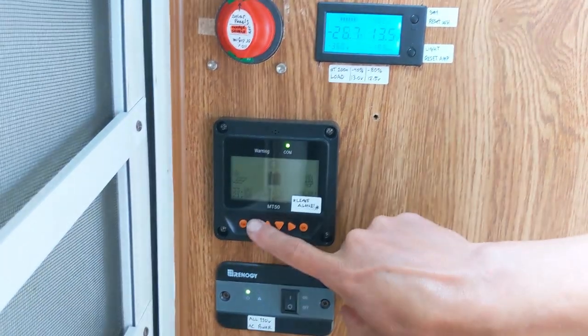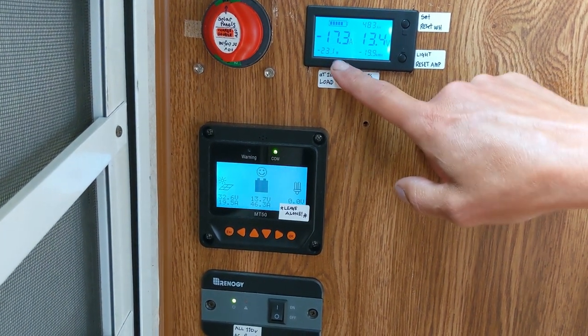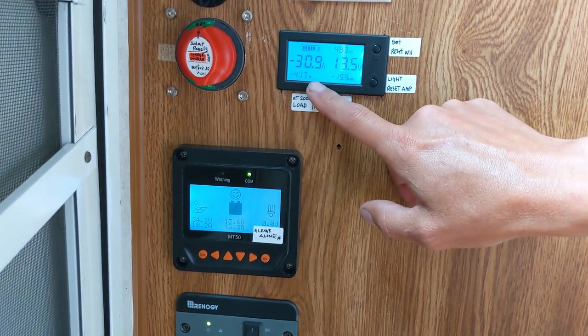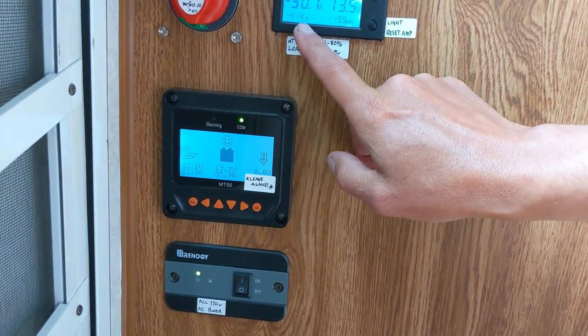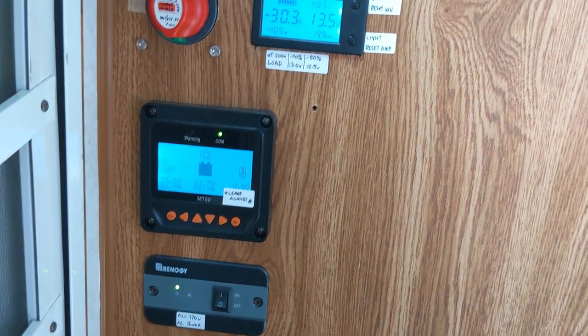You can see here the clouds have gone away a little bit, so now we're actually charging 13 to 15 amps. The charge controller is producing 40 to 41 amps depending on cloud cover, and we're actually now recharging the batteries as well as running all the load. We've got 55 amps of charge coming in — that's about 800 watts. We're charging 30 amps into the battery, which means our AC is consuming about 25 amps. Right now it's running at around 25 amps just to maintain the cold level we have set.